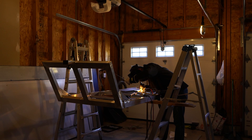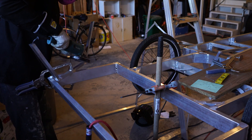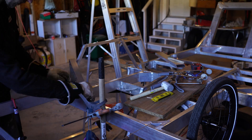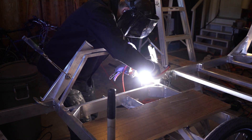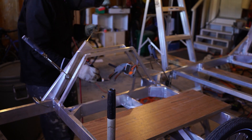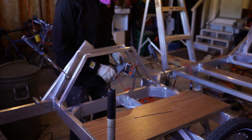I'm just tack welding the fender sections now. Figured I'd start there, grinding out the inside welds while it's easy before I get them installed. Those gusset joints I welded in up closer to the wheel on the corner pulled the frame out of square a little bit, so each of the two pieces of the frame are going to be a little different. I bought these monster squares — not totally convinced it was worth $400. With aluminum, you're kind of learning how it twists and pulls with the welds and the sequence of where to weld first. You just have to do it to get an understanding of how it's going to pull and hopefully pull itself back into shape and square.